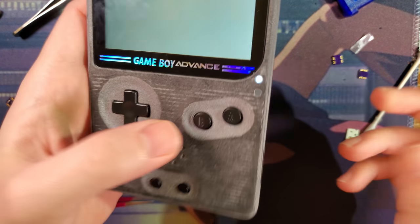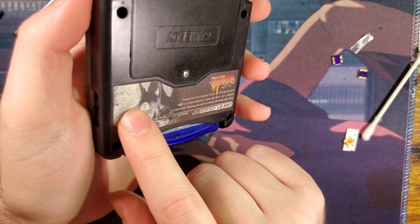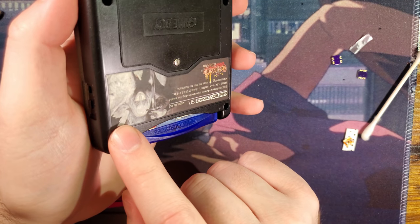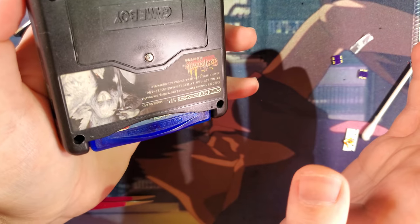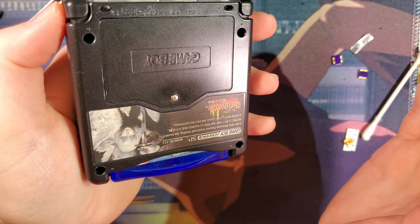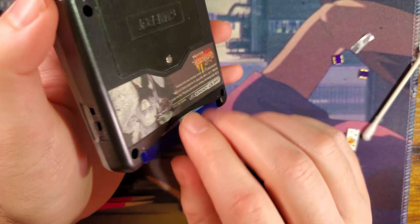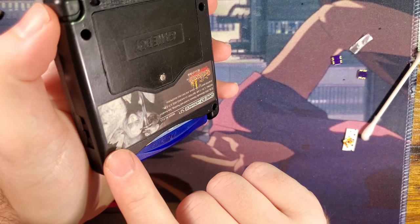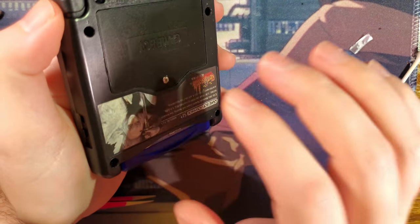I mean, the concept is really simple. It's just we're using this switch to carry much less current. The current to activate the MOSFET in the switch I just installed is very minimal. It requires a few microamps, whereas the Game Boy requires 70, 80 milliamps. It's quite a magnitude of difference. It's still the same voltage, so it should still be hitting the wetting current level of the actual switch itself. But it's moving much less current.